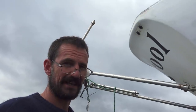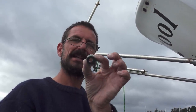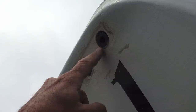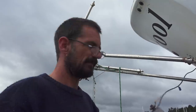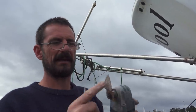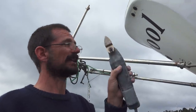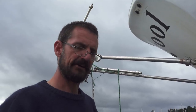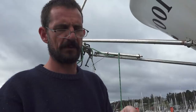So we're here on the next day. Those holes you saw us drill out — I got this HDPE tube with a half inch hole through the middle and stuck it up in there and glued it with epoxy. Even epoxy doesn't stick that well to HDPE, but with my multi-tool and this grout bit that I use for getting rid of fiberglass, I was able to really rough up the outside area and now the epoxy does really, really stick well to it.